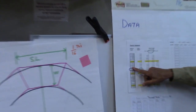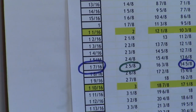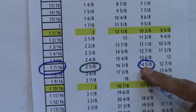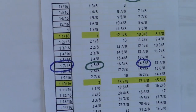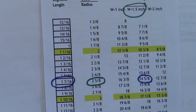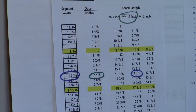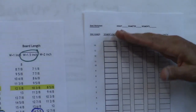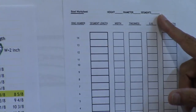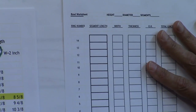On these tables you'll notice places like 'one and four-sixteenths' — that's how Excel automatically rounds these spreadsheets. One thing to watch out for: the board length listed is exact, including an eighth-of-an-inch gap for each cut, but leaves nothing to hold on to for the last cut, so allow a good two extra inches. I sometimes use a worksheet where I know I need eight rings high and a base, numbered one through eight, with name, height, diameter, and number of segments all on one sheet — available on the website to download.